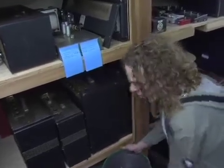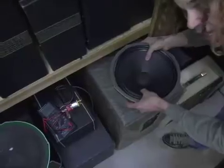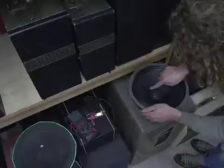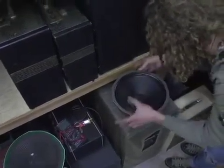The difference between a proper working speaker and this, which is not proper, is that when I do the same thing, it's silent. It's a good idea to spin it. Check it again because sometimes you'll have rub spots only in certain places that won't show up, so you want to do this to the whole cone.